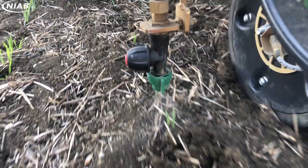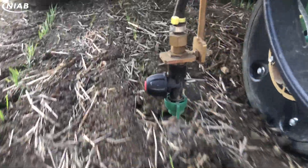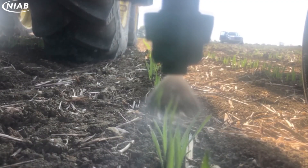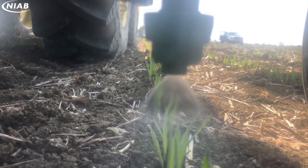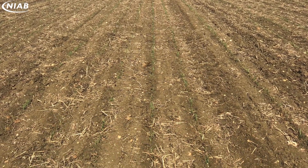This wider row spacing gives additional options for weed management, including the use of banded herbicide, which is what we're going to be doing here. With crop rows spaced 33.5cm apart, a 12cm band of herbicide can be precisely applied over each row. Comparing this to a broad acre application, there is a reduction of 64% in herbicide use. It's clear to see here exactly how much ground has been left unsprayed.